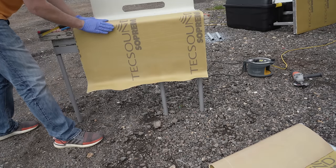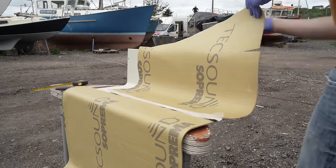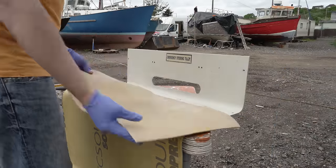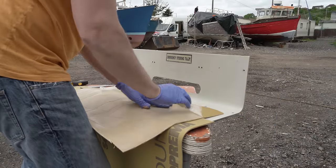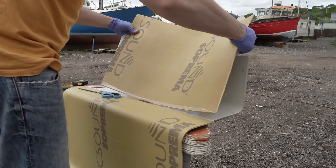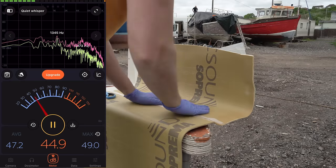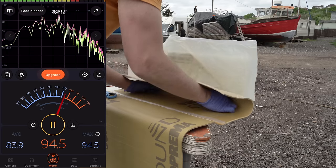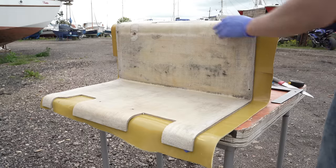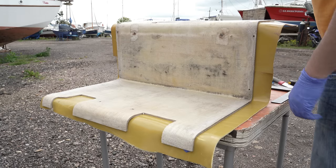On the non-adhesive side of the mat — the side with the logo and branding on — there's another transparent film on it. But if you try to remove that, it refuses and stretches and rips messily, so I left it. I'm thinking probably two layers — what a maverick insulator would call TechSound 200 — but I'll do a decibels test first once all screwed back together again. There's no point adding dozens more kilograms in weight if this does a good job. Flipped over, the edges have plenty of spare once again, and I can go around and carefully slice the extra off, which is quite satisfying.